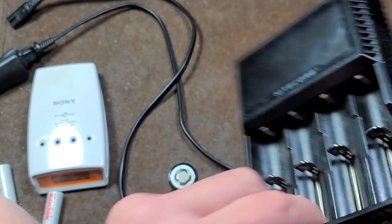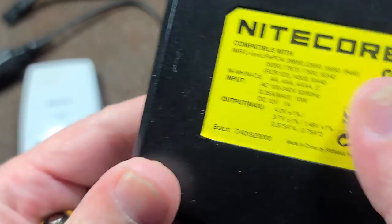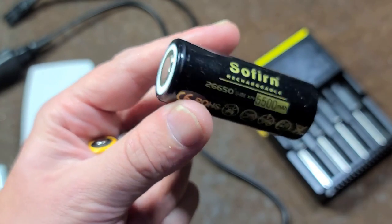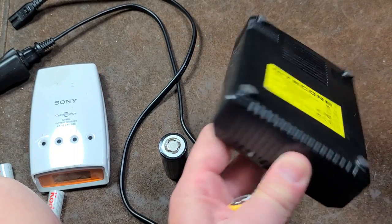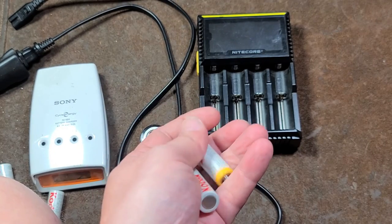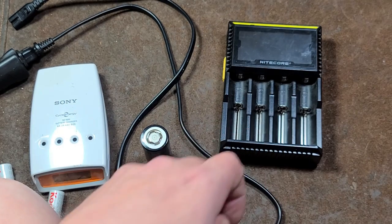The other disappointment is just such a low output current. 0.375 amps times four — that's low. And even at the regular charge rate, which is times two, 750 milliamps — to charge up a battery like this which is 5,500, that would take six or seven hours. For the $35 to $40 they want for it, not actually holding four of the batteries it says it's compatible with, and being unbelievably slow, is not worth the money. I'd find something different — unless you can find this like me at a thrift store for a few bucks.